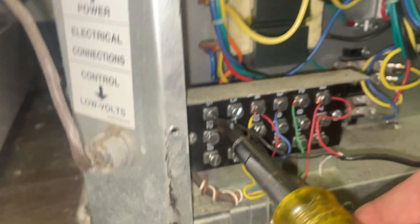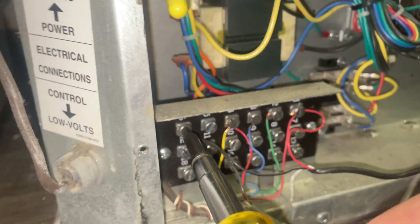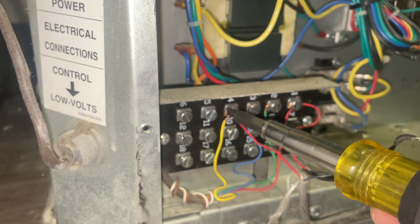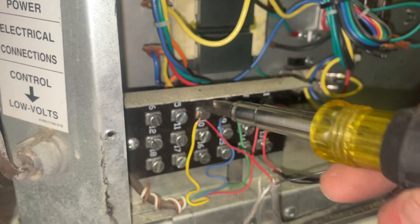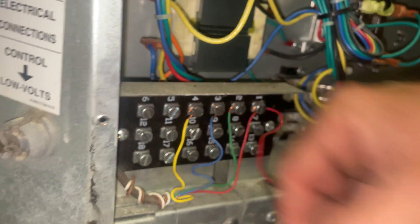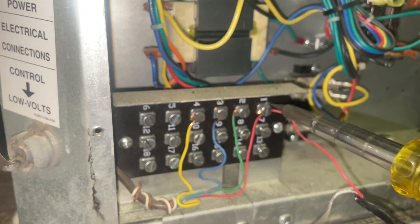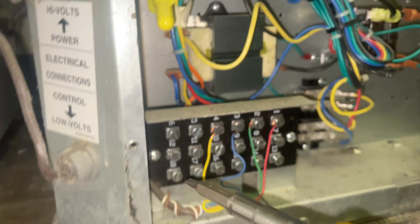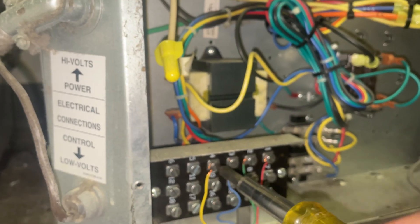This is property specific — it's an old regulation system where they used to regulate power usage. This electrical company went out of business many years ago, and we still have all these energy star devices that can sometimes trigger the air conditioner not to work. So I just remove them on every single one, as they are no longer in use and just cause problems.